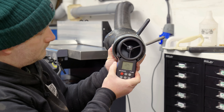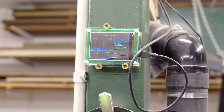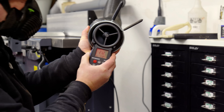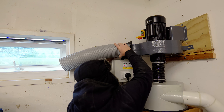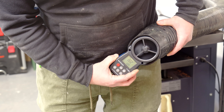Airflow readings were peaking at around 22.5 metres per second. The exhaust from the machine kicked up quite a lot of sawdust in the air as you can see on my air quality monitor, so I quickly put on a respirator. I then installed the ducting again between the motor and the filter and tested again, and the readings peaked at around 21.3. So that's like a 5% drop from adding the cartridge filter, bearing in mind the filter is very clean because it's new. I don't think there's much to be gained by exhausting this outside at all based on that experiment.